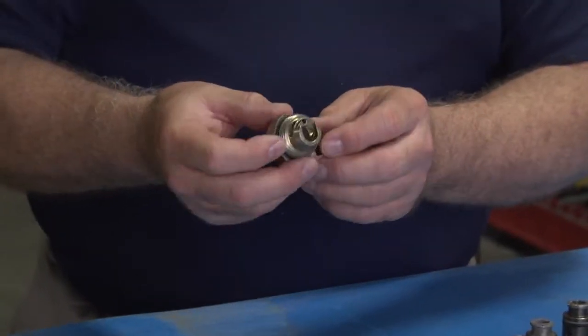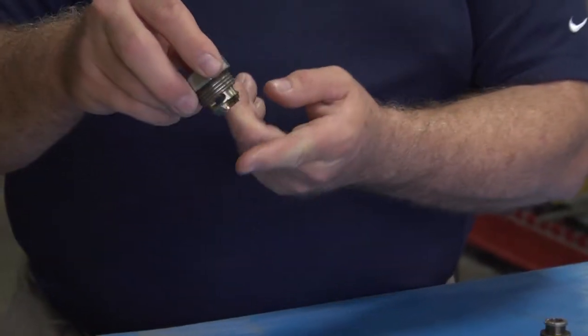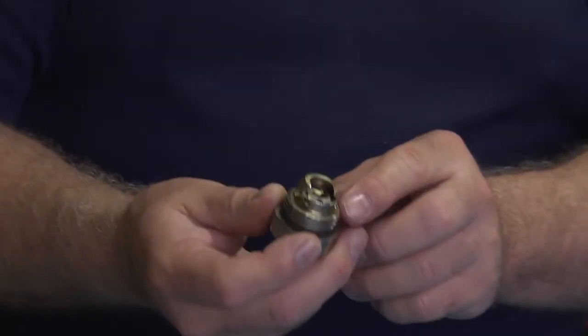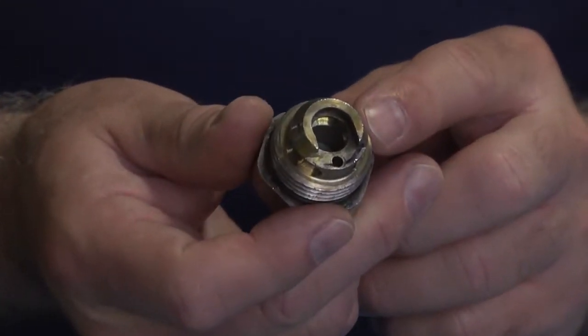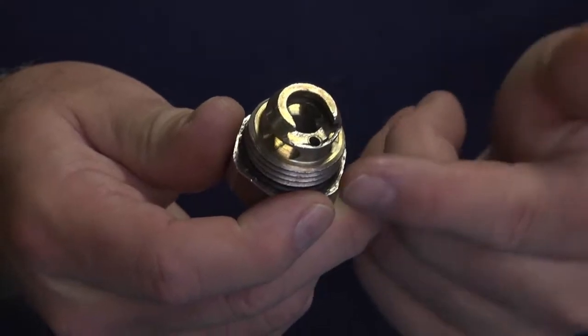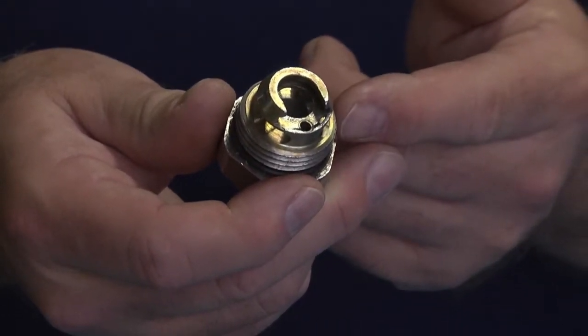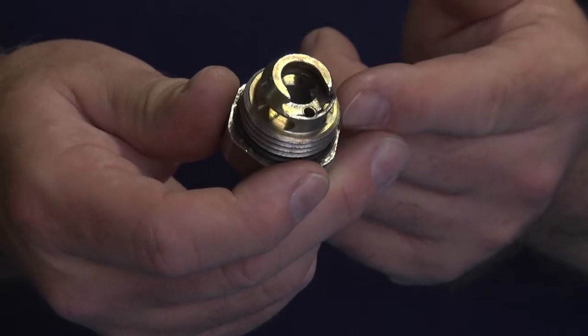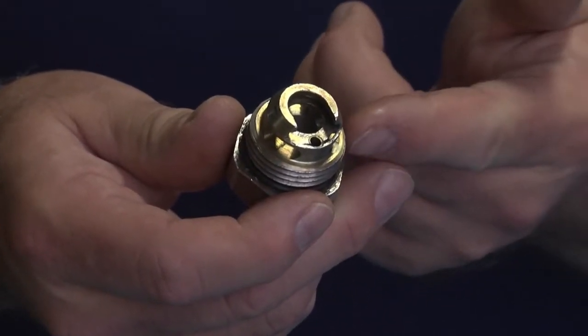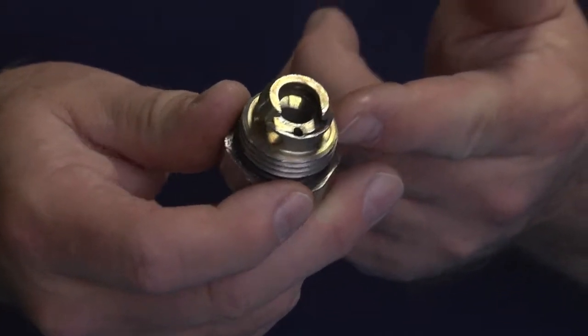The second one is the cap off the shotgun that we took a look at earlier that holds the cartridge. You can see in this one, there is an extreme amount of erosion of the metal. In fact, the ball bearing has fallen out completely. And this is caused by feathering the trigger of a shotgun. Now, I told you we would discuss what feathering the trigger was at a later time.